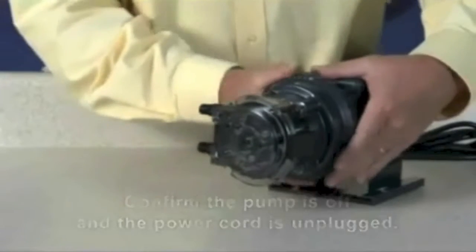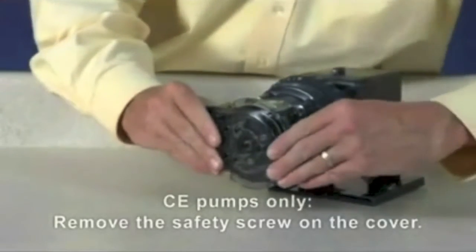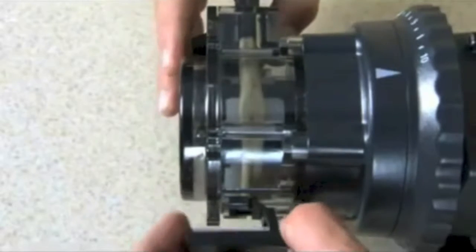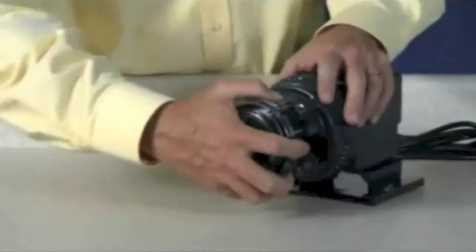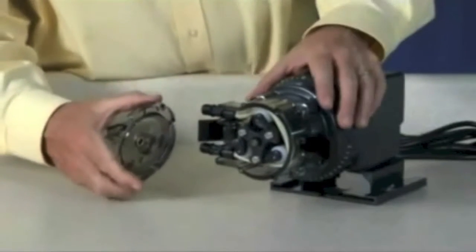Feed rate control is set to 10. Open the back and front of the latches on both sides of the head. Carefully fold the latches back to prevent contact with the cover. Remove the tube housing cover and flip to use as a tool to collapse the roller assembly.